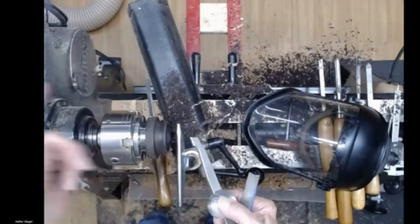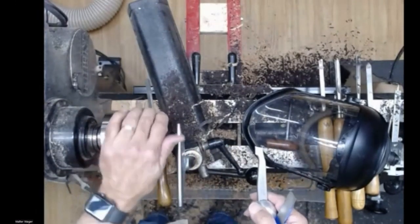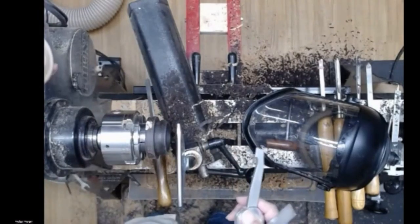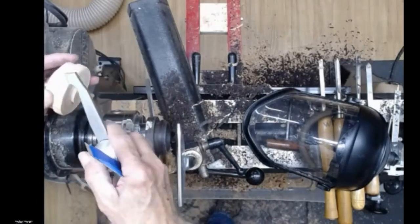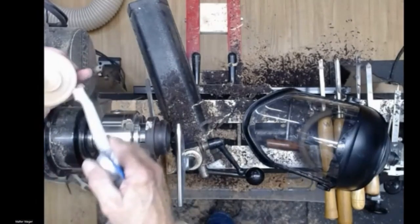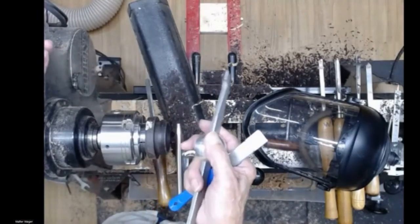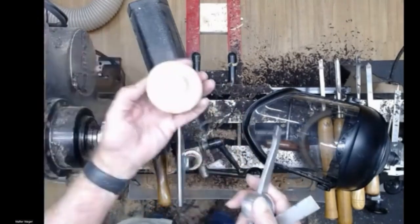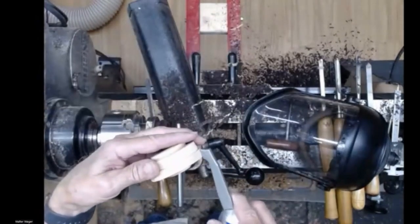Especially if you're using blackwood. If you're using softer wood, it just doesn't work well with real soft wood. You can flood this with CA glue and harden it, or if you have a stabilizer system for punky wood, put it in a vacuum jar with cactus juice and bake it, and you'll have wood that's hard enough to do that.